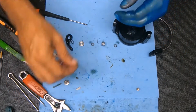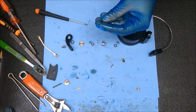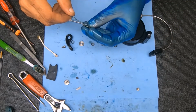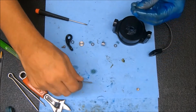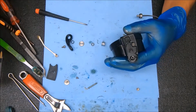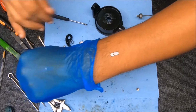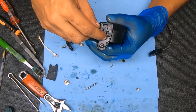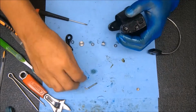So for this side, we have the arm with the shoulder on top of it. That's going to go inside the spring. There's a brace on the bottom. I believe both sides of the spring are the same size, so I'm just going to stick it through. Essentially, you want this arm looking like you want it even over that gap right there. Now you'll notice that this is offset. It's not completely centered, so we want to line that hole up with the largest area for the gap. Somewhere around there looks good. Having more to the right would be ideal.